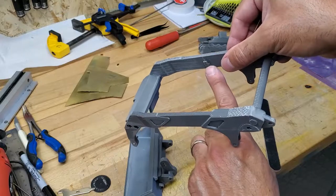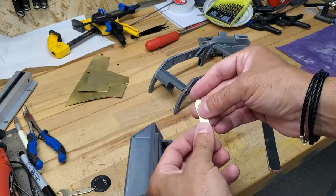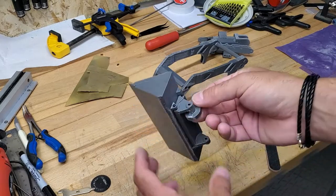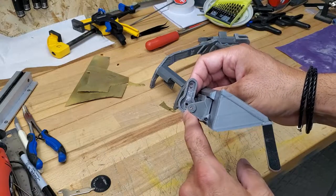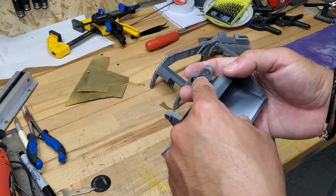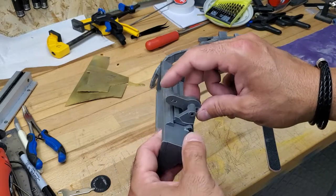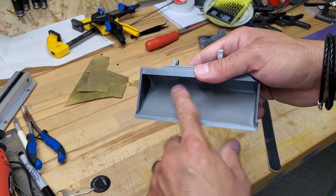There's a little bracket here for the servo wire that'll run from inside, and I'll show you how to do that in a minute. You can get some brass, use tin snips, cut it, sand it, and epoxy it in. The bucket itself — print it flat like that. This back support piece prints flat as well. This is for a 20kg servo with a servo horn shaped like this. If it's snug you might not even need screws, though I'd cut the servo horn halfway so it's in there and held but still looks realistic.